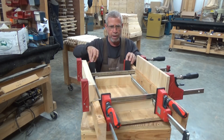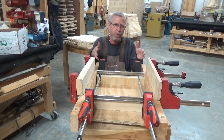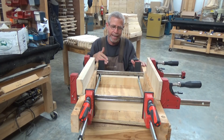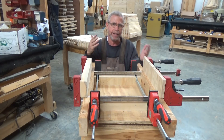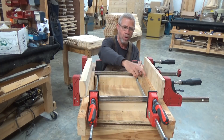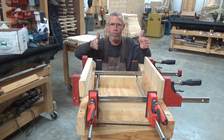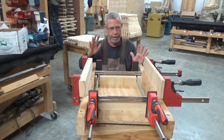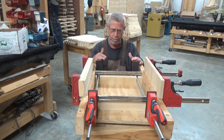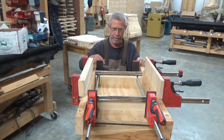These are situated so I can just take a box and drop it in. That's always the hardest part — getting the first set of clamps on your box without it racking and getting out of square. This fixture automatically gets the box in square. As long as the sides are on the 2x4, it's going to stay true, it won't rack out. Once you start clamping it down, it'll all square up and be in place. Then we just put the box on here and put the other clamps on top.